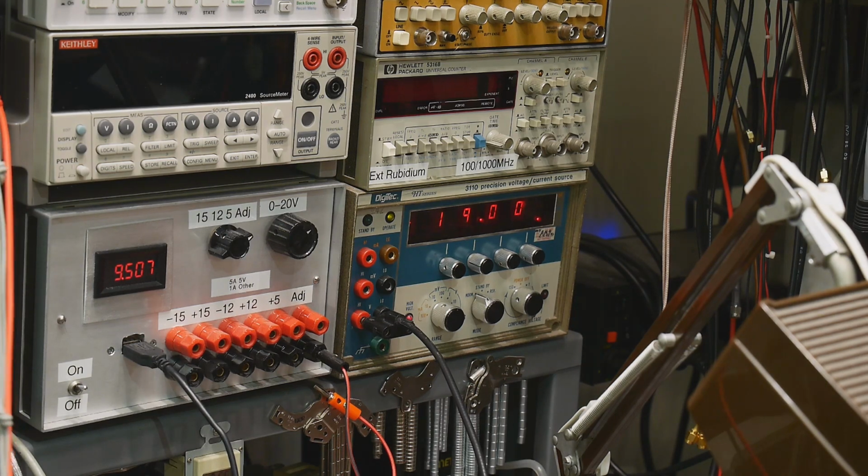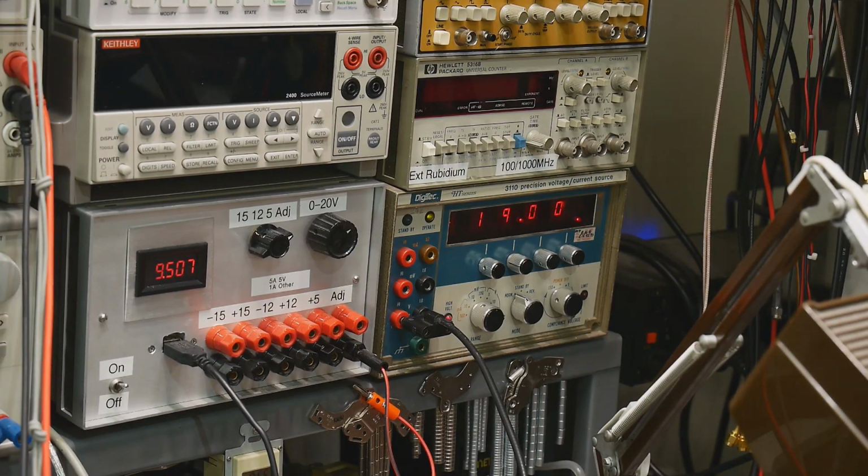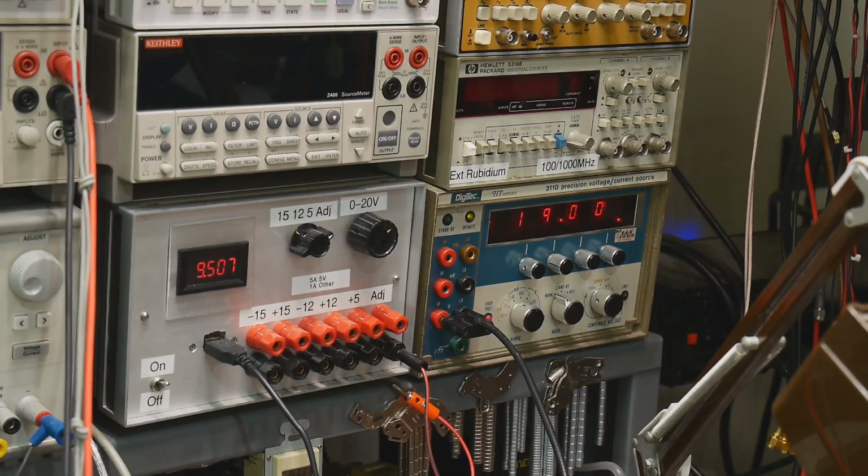Let's check it with our 6.5 digit voltmeter, make sure our 19 is 19. Our DC volts. We are bringing in 18.99, yeah, it's 19 volts. That is measuring exactly the same as the other meter. 18.994, and this meter's measuring 18.99, so I think it's in spec, so we won't touch that one. Okay. If it's good, disconnect the DC standard and continue with paragraph 532.